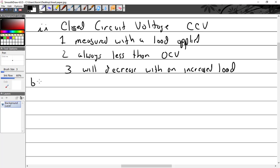And that brings me to something called internal resistance, or IR. How do you measure the internal resistance of a battery? Megohmmeter. It's open circuit voltage minus closed circuit voltage. Describe that. It's a really, really big ohm meter that measures really massive amounts of resistance. Yes, we just take an ohm meter and put it across the battery. Perfect. That'll go kaput.